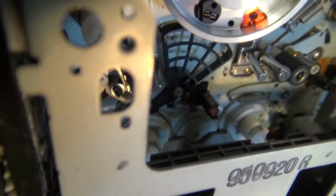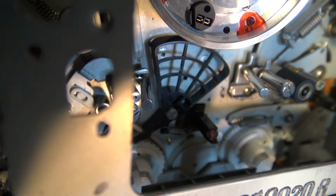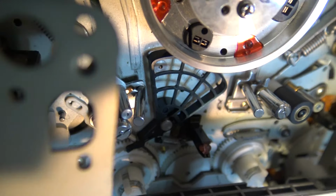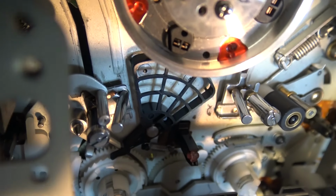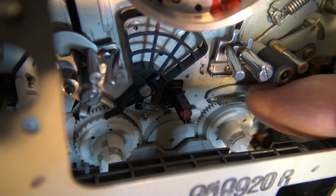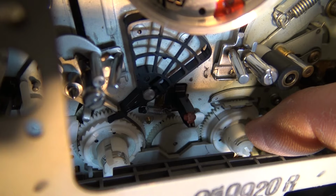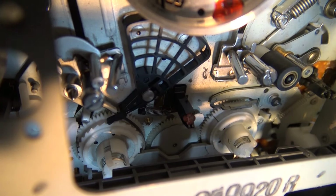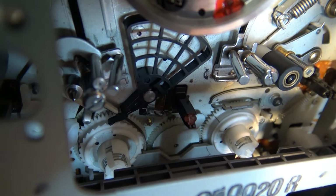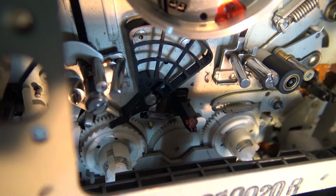And what causes the problem is this plastic gear. Well, we'll take it apart, but it actually has a metal component to it. Now my camera's not going to focus. Maybe it will. It can do it. It has a metal component to this. And what happens is with heating and cooling, the metal core in the middle expands and it pushes on the gear and cracks it. The failure rate on this was 120%. Okay?